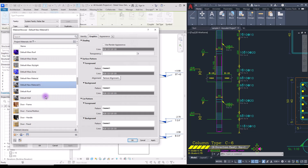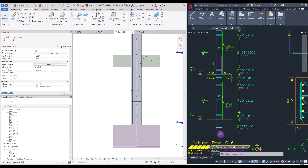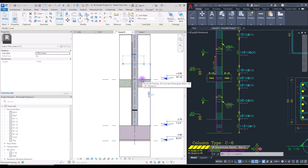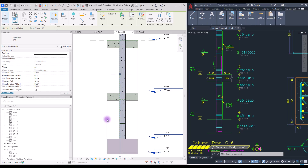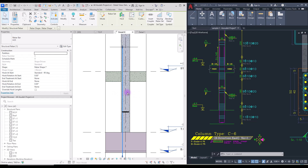It's a 6.5 meter rebar and if you want to set the exact length, scroll down and change its size directly from there. Now the rebar starts from this point, meaning we need to move it down to the foundation. Create a reference line here — from this point to here is 145 centimeters. Input 145 into the dimension and then move the rebar exactly from this point to the correct position. For the end hook, create a 90-degree hook, and hit Space if you can't see it.